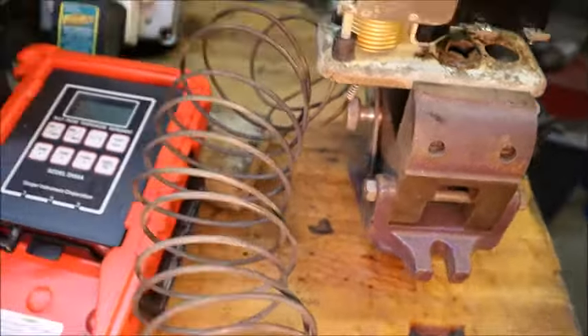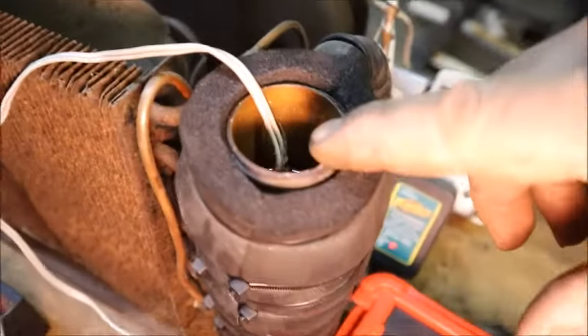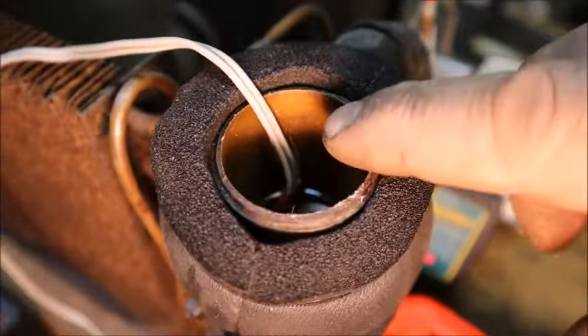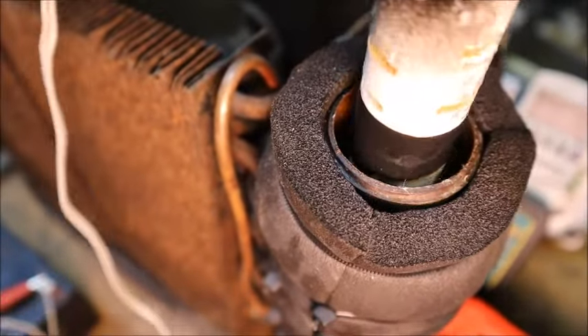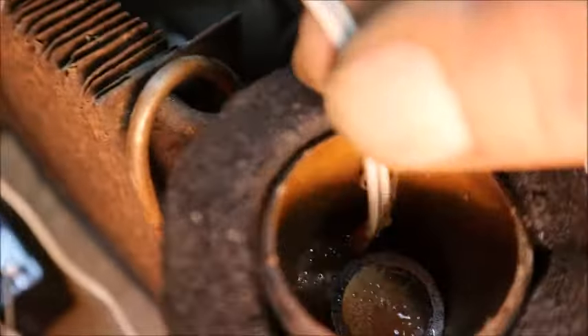The cold well machine is very simple — it's an old condensing unit from an Ideal slider coke cooler. This is a double wall copper pipe and that's the evaporator; the refrigerant boils in between the two walls of the pipe. There is an agitator in here, a little pump that helps to minimize a temperature gradient.